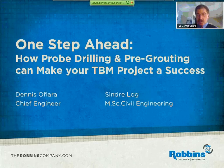Welcome everyone, and thanks for attending. As Cendra and I will do this presentation in round robin, we're going to describe applying drills to TBMs for reconnaissance, probe drilling, and pre-grouting ahead of excavation. This isn't anything new — it's been done quite a long time ago on early TBMs, but we're constantly trying to apply it in a better way and improve the process. We'll focus on applying drills effectively on TBMs so that drilling can be done in a routine and efficient way. We won't focus on the grouting materials or grouting equipment, as there are many other experts who know that field better than we do.